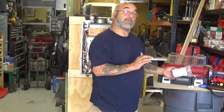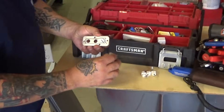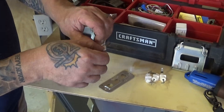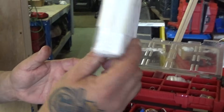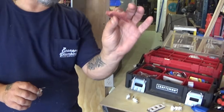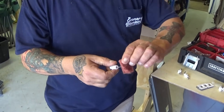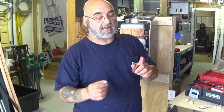For this purpose, you don't always have a workbench, but a piece of wood works fine on top of a garbage pail. You're going to remove the two flame rods, the rubber piece, and the igniter. There is a gasket — be careful not to break it. Always have an extra one; you can find an extra inside the flame rod spare parts bag. Now inspect your igniter — take a look at it. There is a little bit of buildup on it. What you want to use, and only use, is a piece of Scotch-Brite pad. All you want to do is pull nice and steadily. Don't use a knife, a screwdriver, a file, or any chemical — just a piece of Scotch-Brite.